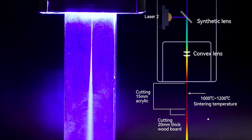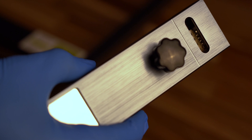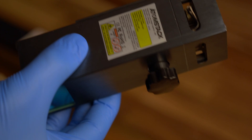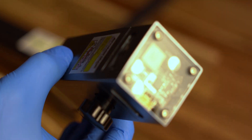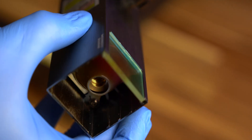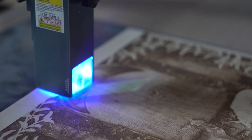In terms of lowering the focus area, you can get it down to 0.06 millimeters for more fine image engraving. In terms of engraving speed, it's faster too. With a 10-watt laser, the X7 Pro can achieve 11,000 millimeters per minute, compared to something like 3,500 millimeters per minute with 5-watt laser engravers.